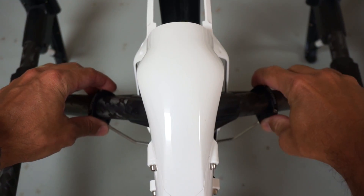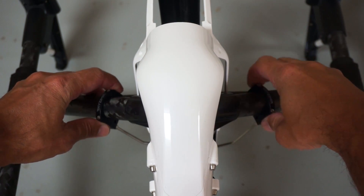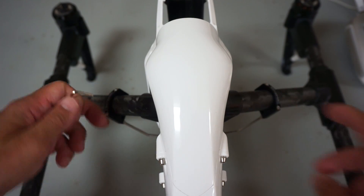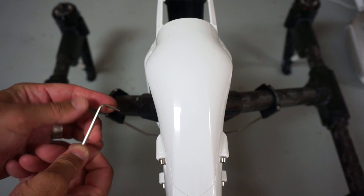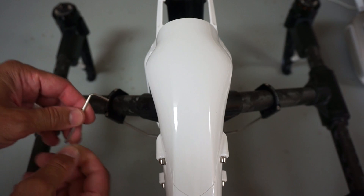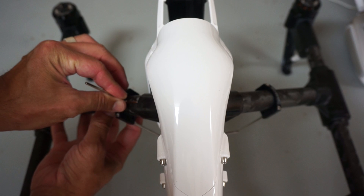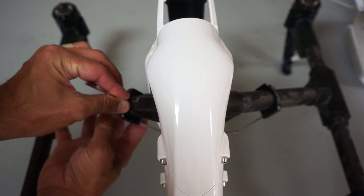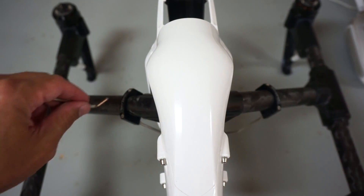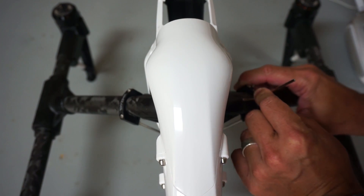I have these mounted now, not too tight, so you can see I can move them up and down. We'll go ahead and get them in place and then tighten the screws. To get these in the right place, this wrench — according to the instructions I've measured it — is 20 millimeters on the short arm. So we put it up against the plastic arm holder and slide this side of the Stork up to the other end of the wrench, giving us about 20 millimeters of spacing. We'll do the same on the other side.